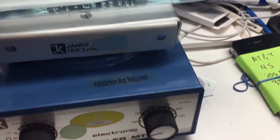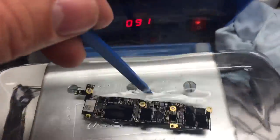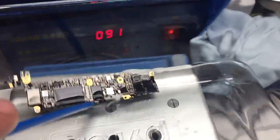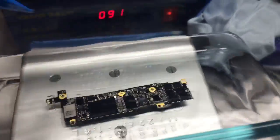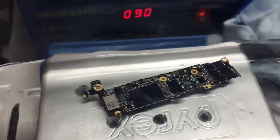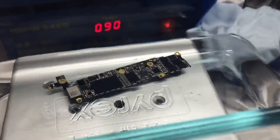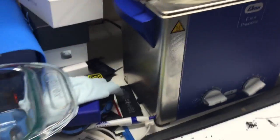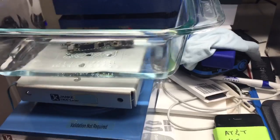I don't know if it's going to help or not but it certainly can't hurt. Once I get the board out of the alcohol I'll hit it with a little bit of canned air to get most of the alcohol off, and then I sit it on my hot plate here to evaporate the rest of the alcohol and any water that remains behind from the board. If you have any questions about this or anything else, ask them in the comments — thanks for watching, this is Trent with races4dinner.com.